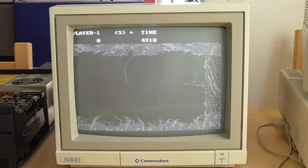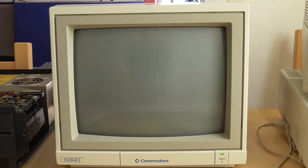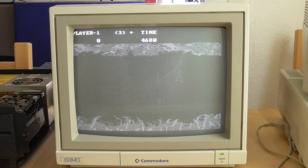This is the game Jungle Hunt, which is designed for 320x200 16-color composite mode. But as you can see, I'm only getting a black and white image here. This has to do with where I'm actually living — in Europe we have a completely different television standard called PAL compared to the North American NTSC standard. Colors are encoded slightly differently and resolutions are a bit different. This PAL monitor can understand the picture information but it can't understand the color information of an NTSC signal. As far as I can see, all IBM CGA graphics adapters were NTSC — there were no PAL ones made.